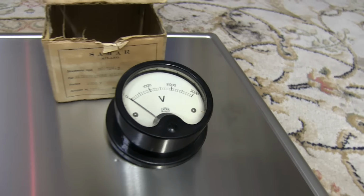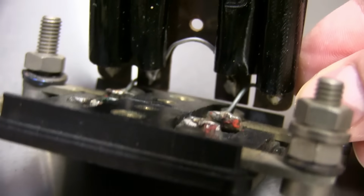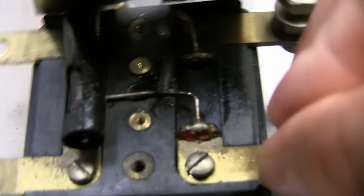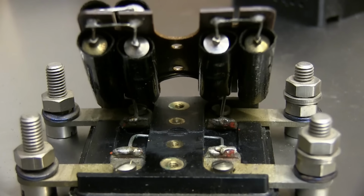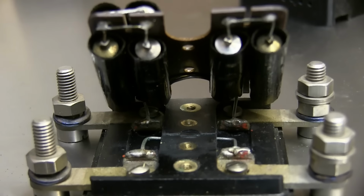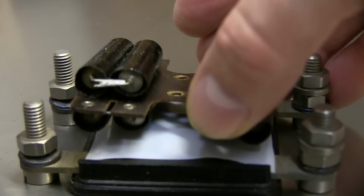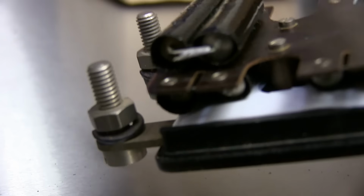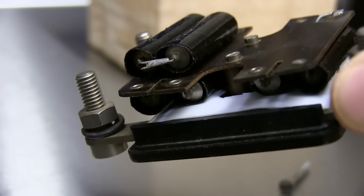That's a bit better, isn't it? Good. That's not going to cut into those resistors like this one. Problem solved. A bit more insulation perhaps. Well, this has definitely improved this resistor network for that meter. For a bit more insulation, I'm going to pop that in there. That can handle 5 kV or so, I think. Easy. That's definitely looking better. 2 sheets of that high voltage insulation. Those resistors won't get damaged now, will they? Good.